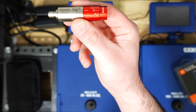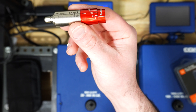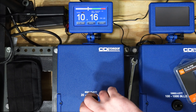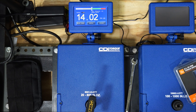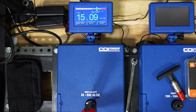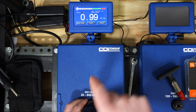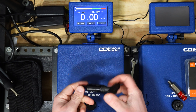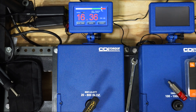We're going to start with the All-in-One Fix-It Stick here at 15 inch-pounds. You are going to have to stop when it gets to that 15 indication. I did warm-up cycle it. At each torque setting, I'm going to get three readings — testing the Real Avid, Capri, Wheeler Stick, and Fix-It Stick.